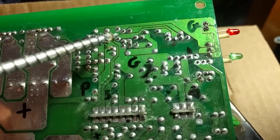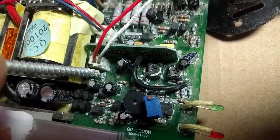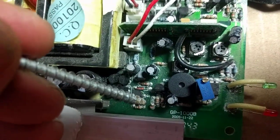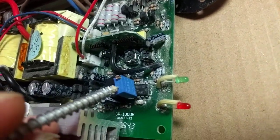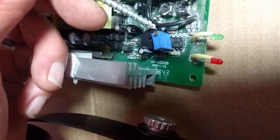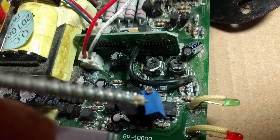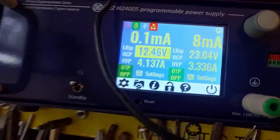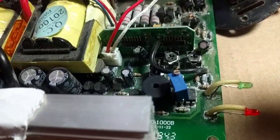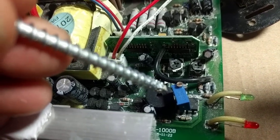Because the divider ratio depends on the values of the two resistors compared to each other, we can alter either of them. What I did, just to keep it easy, was that the old resistor — this one down here that I've chopped off — was 15K. So basically I chopped that off and replaced it with a 20K trim pot here, wired in the same electrical place. It's wired onto one side of the comparator and the other side to ground. So essentially this trim pot is just replacing that resistor but making it variable. I've already adjusted it — I set the power supply to my cutoff voltage and adjusted the trim pot until it beeps, and then you're done. So this is now modified so it will work fine at 16.8 volts and turns off at 12 volts.